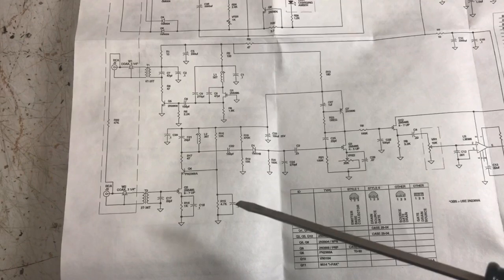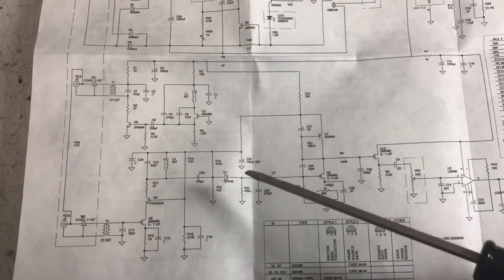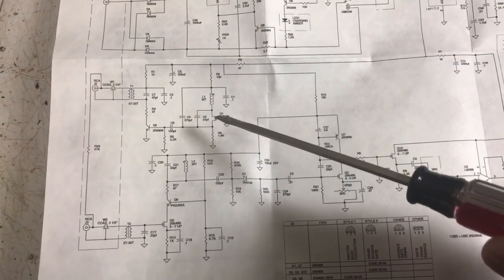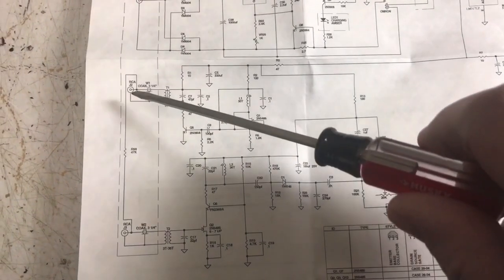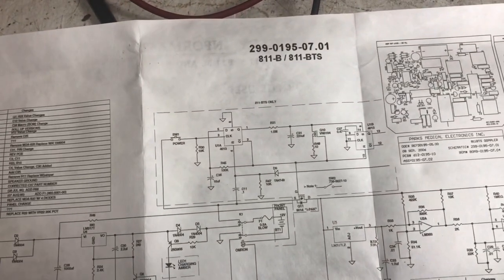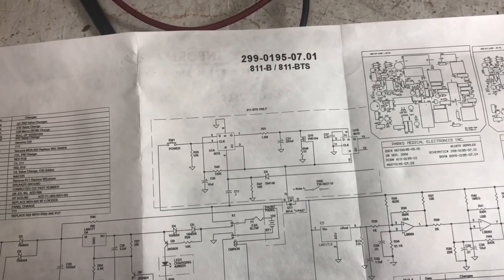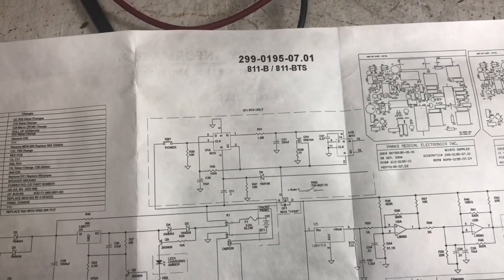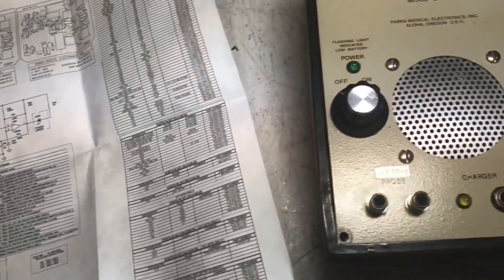They used TRF receivers back in the 1920s and 30s, and here we are using a solid-state version in 2020. Two-stage transmitter, very simple. It's an LC circuit that determines the frequency, amplified and then out to the jack. There are other features too — a timer circuit in some models keeps power on for five minutes and then automatically shuts off so you don't run the battery down, and you can reset it at any time. This particular unit does not have that feature — it's just an on-off switch, a volume control, and the probes.